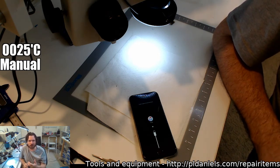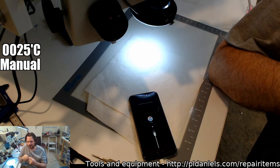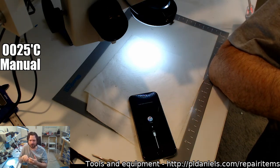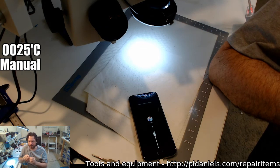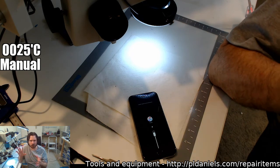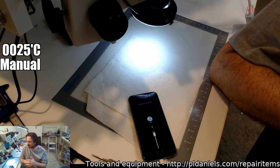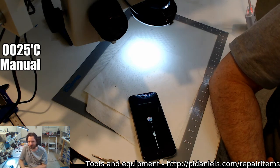I need to learn more about how the USB data communications works. It's obviously a lot more complicated than straight serial. You have to set up things properly. It may even require me to register for a unique vendor product ID, but I don't know if you can do that anymore as an individual. You used to be able to through OBDev or VUSB. They had a program where they bought a block of USB IDs and then you could just buy one for yourself, but I don't think you can do that anymore, which is unfortunate, because in my case, I would probably in my lifetime need no more than 2 or 3 IDs. I don't want to go and buy a block of 100.